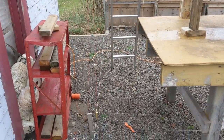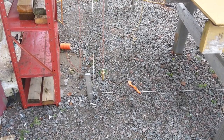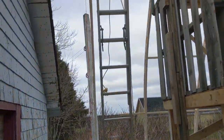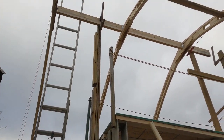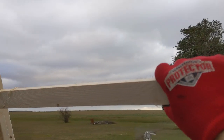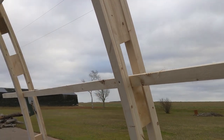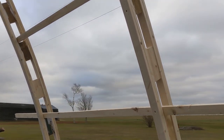Just have a little bit of adjusting to do — I'm about two inches from where I need to be, but that's easy to rectify. I'm going to be putting some purlins in now. The purlins are like these pieces here — there's a one-by-two and two-by-two, every four feet as you go up. That'll help with the rigidity of the frame.